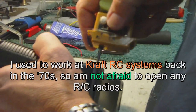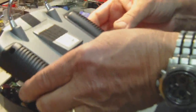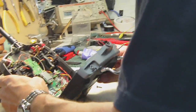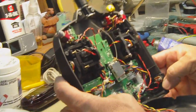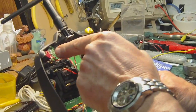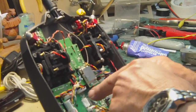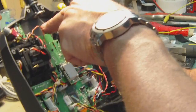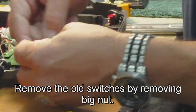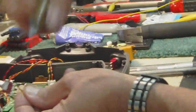I've never opened up one of these, so it's going to be interesting to see what's inside. Here are the two switches I have to replace — I have a couple of those so I'll replace them. I'm going to go into the power here and wire in an LED, and it looks like I have a place right there to put it. It's a regular switch; it doesn't matter what color wire goes where — it's a single pole.